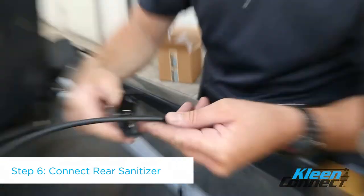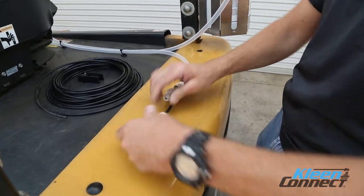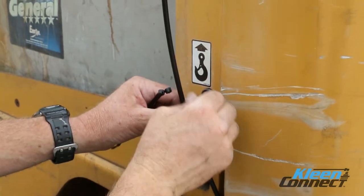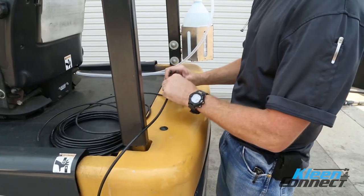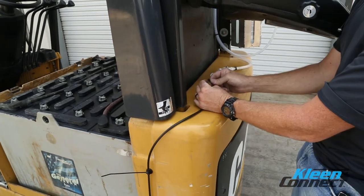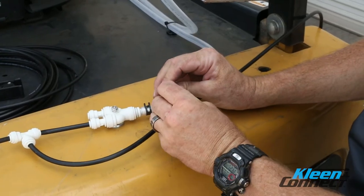Using the provided tubing cutter, cut a 3 to 4 inch piece of black ¼ inch tubing and attach to the outer discharge fitting on the branch manifold. Attach one of the push fit T's to the other side of this 4 inch piece of black tubing. Starting from the rear wheel nozzle location on either side of the forklift, attach one end of the ¼ inch tubing and route up the body to the push fit T. Secure the tubing to the body with the tubing magnets and ties. Once you are sure of the route, you may cut the ¼ inch tubing allowing for an extra 6 inches or so for nozzle adjustment later. Check to ensure that opening of the engine cover or seat lifting will not interfere with or pinch the tubing. Repeat this procedure on the other side, checking for proper placement and secure with the tubing magnets and ties. Cut the tubing to the proper length and insert it into the remaining connection on the push fit T.